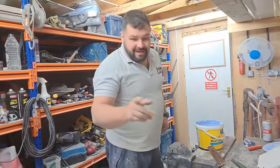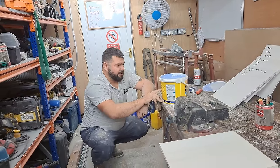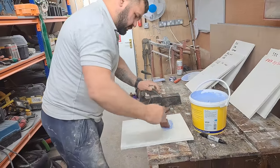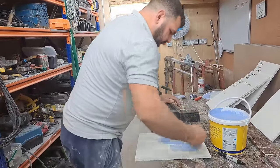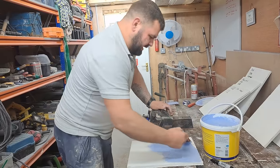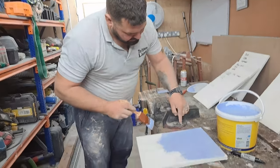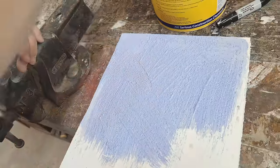Now for the blue grit sample. According to the instructions, allow it to dry thoroughly before applying plaster - usually six hours minimum - so this will have about 24 hours, making it a fair test. Some guys apply this with a roller. You can't spread it too thin or there won't be enough grit present - I want this to be a really fair test so I'm making sure there's loads of grit. If you brush a section and there's not much grit present, that's not good enough.